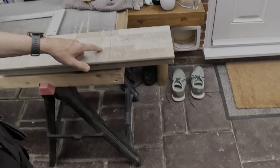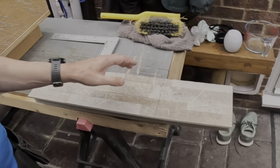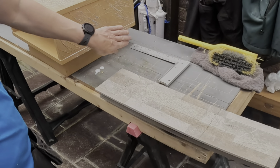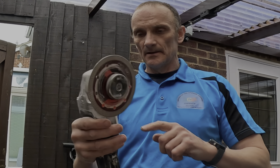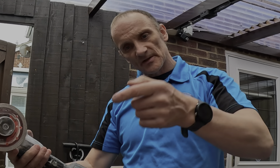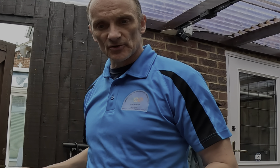I'm going to cut six tiles on the line — that's my waste on that side, and that'll go across there and across there. Going to use my angle grinder — just a straight cut with mask and gloves, then clean the edges with my diamond hand pad which I'll show you in a minute.